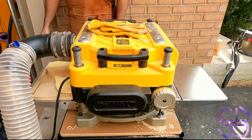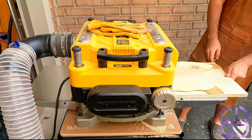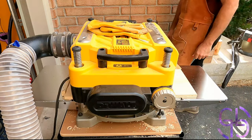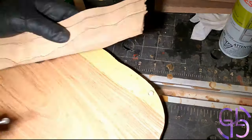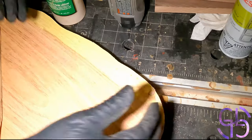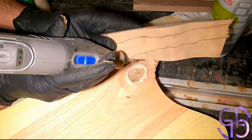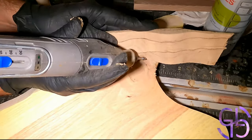If you notice, I did use some wedges to prevent it from wobbling, because even though it was cut straight, it warped just ever so slightly, and that amount was enough to be unacceptable for me. One of the issues of passing it through the planer is that the blades tend to destroy all knots on the wood. So, I had to inspect the two spots where the knots were present and seal the damage up with some sawdust.